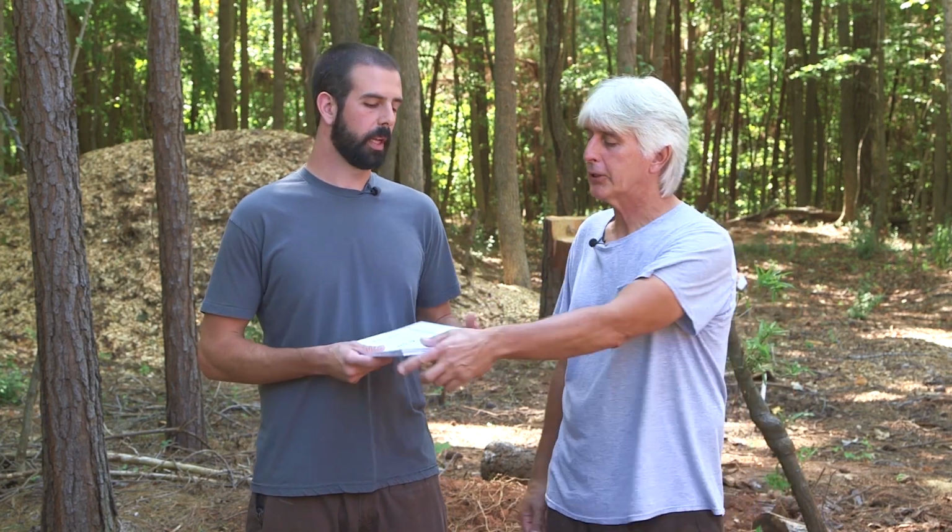Today we're out here getting ready to have Duke Energy bring in power from the main line on the road back into the woods for us, with a transformer. We had a few specifications we had to meet, and one of those comes from a book like this. We had to call and meet the engineer, and he actually gave us this book, which we had one already because we do residential electrical work for one of our jobs. And it gives us the details of how to set a temporary pole for them when they come out.